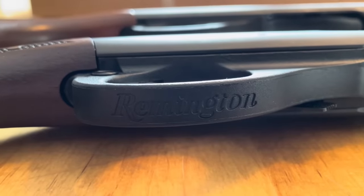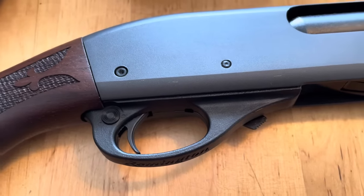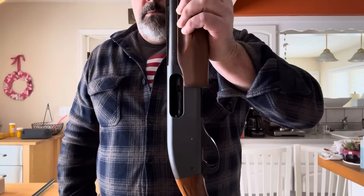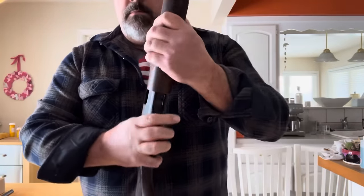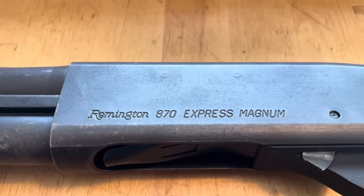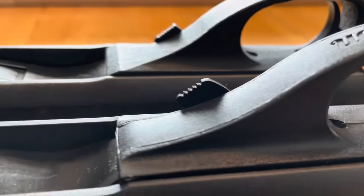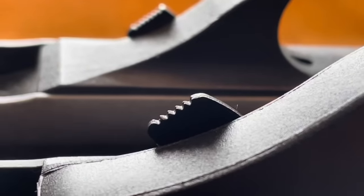Looking at this trigger guard — it is made of polymer or plastic. I know some guys don't like that, but I think it should be, since it's typically the first part to break. It's unchanged from the old version. Now talking about the action: we're looking at a 30-year-old 870 Express where the weight of the gun itself does not forward the slide — you have to give it a jerk. Now looking at the 870 Fieldmaster, brand new, hasn't been worked in — it's amazing. The biggest reason for that improvement is they're doing what's called tumbling the action bars, which is some extra machining that makes them run a lot more smoothly. I also noticed the slide release button is larger on the Fieldmaster than on the old 870.